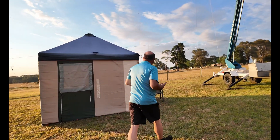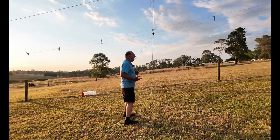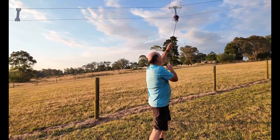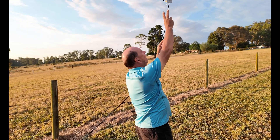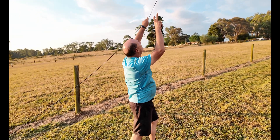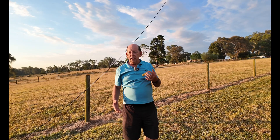I'll move under the antenna itself and show what it looks like at the feed point. Just under here — we're under one of the dipoles. I'll tug on the feed line a little bit and bring it down. We've got an open feeder going to the top dipole, and there's a 1-to-1 balun which takes it from the unbalanced coaxial feed line to the balanced feeder for this dipole and the one above. It goes up through a small twist and there's a little spacer that's come away, but it's not too much of a worry.